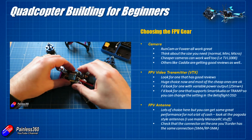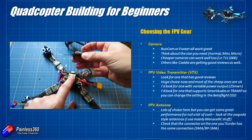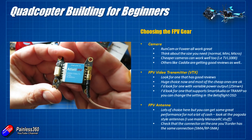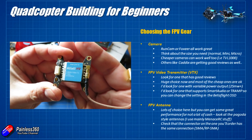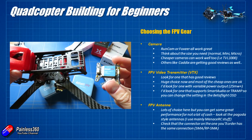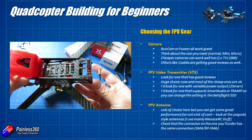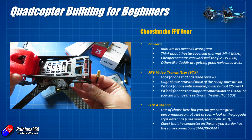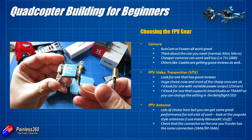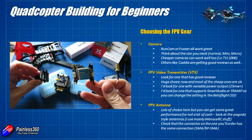If you try to fly when you and a friend are both set to exactly the same band and channel, the signals will compete with each other and neither will display properly. This time we're going to use this product from Holibro. It's designed to sit on top of the stack, but unfortunately there won't be enough room in this particular frame to stack them all, so there's loads of room behind the flight stack where I can pop it and it will work great. It allows me to change power settings, band, frequency, and channel through the on-screen display, and provides a clean voltage out to the camera to avoid interference.